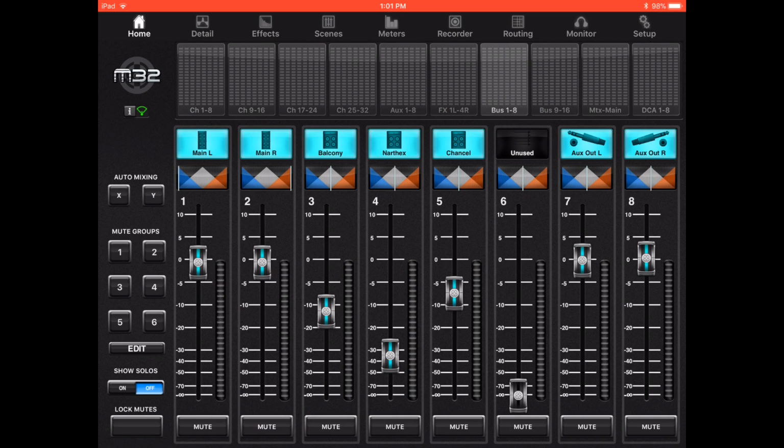And these outputs are 1/4 inch female jacks, a left and a right in the sound system. And this is how we capture audio for the streaming. So what happens is these outputs go to 2 more wires that go back up to the gallery. So up in the gallery, there is a metal box with 4 XLR jacks, 2 on the top and 2 on the bottom. The 2 on the top are inputs, and they are wired to go to the rack mic 1 left, rack mic 2 right. The bottom 2 of those jacks we use as outputs.